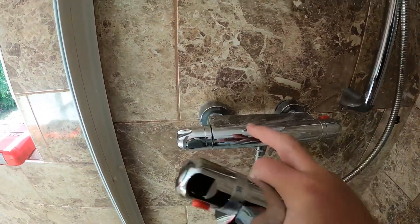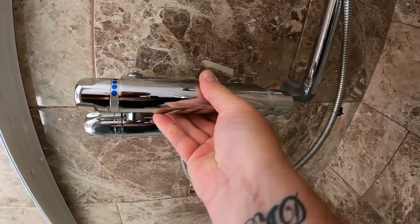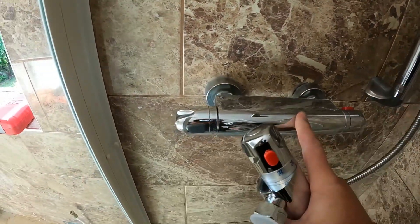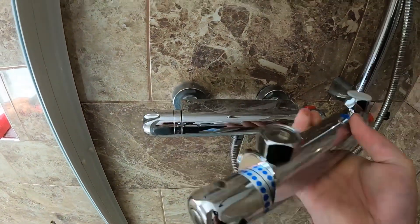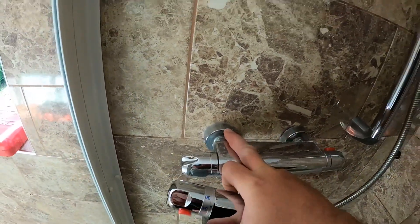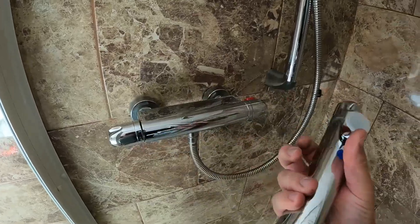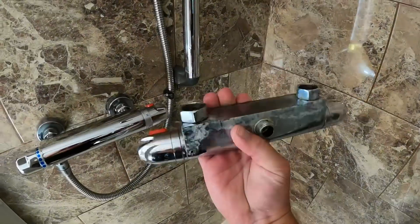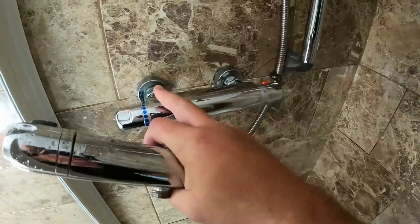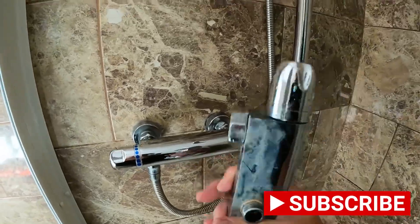That's the water off now — probably took about 10 minutes for it to completely drain out. We've got a bath here running, a bath next door, and the kitchen sink running. What I'm going to do first is switch out this existing bar shower. The customer just wants a new bar shower putting in. The centres are 99% of the time always the same — 150 centres. I've come across a shower once years ago where I think the centres were 160, never seen one since. So as a rule of thumb they're always 150. The system's drained down — crack the nuts off, get this one on, leave the cowls because they're siliconed in and I don't want to disturb it too much. Just switch it out and pop the new shower on. Just those two nuts off the side, pop the new one on, tighten it up, connect the hose — done.